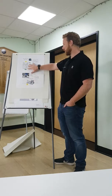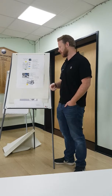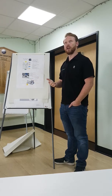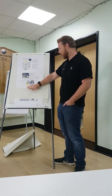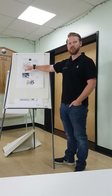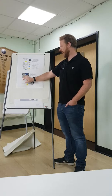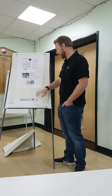Looking at the future state — taking into consideration what we know about how the company sits, ergonomic improvements, and protection of the product and the associate — here's a graphic showing an ESD electrostatic protected area. What we would require is a clean and dust-free environment. Dust is an insulator which prevents ESD dissipation, meaning static remains in the product. This area is based within a leather cutting area, so there's a lot of leather dust that flies around and could void even the most protected ESD area.